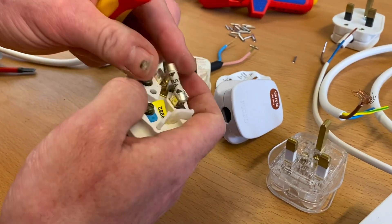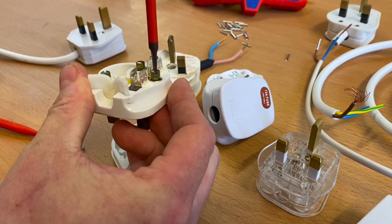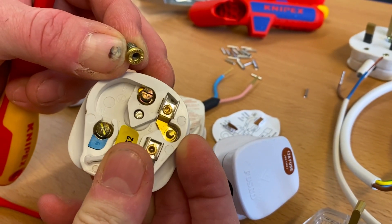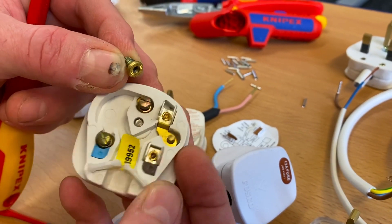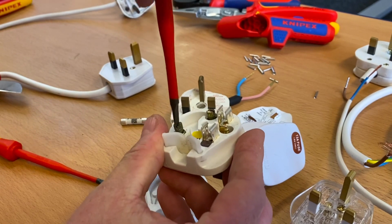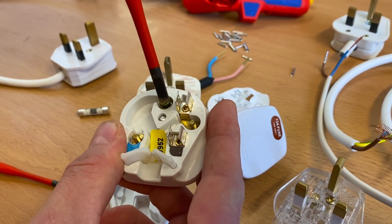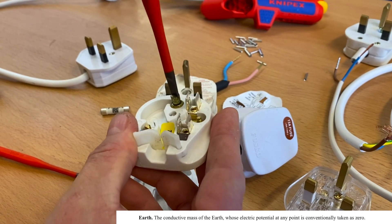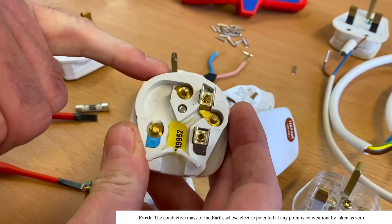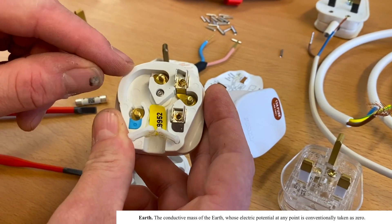I'm going to take out the fuse and undo the three terminations using my medium flat-tip electrician's screwdriver. You can see we've got a stud and connection for the line, colour-coordinated with brown. The blue is neutral, and we've got the green and yellow earth. If you look at BS 7671, the term 'earth' means the greater mass - the physical planet. I use the word CPC a lot when talking about circuit protective conductors and protective bonding conductors.